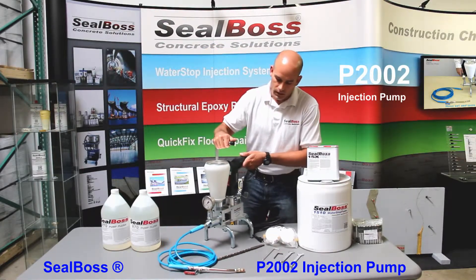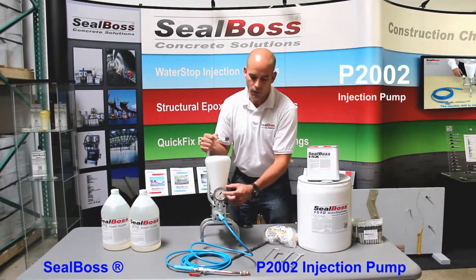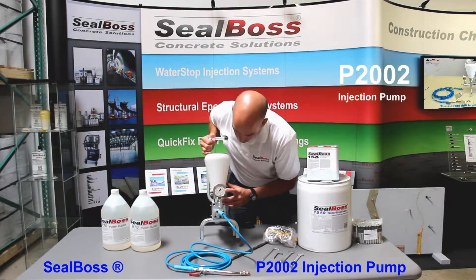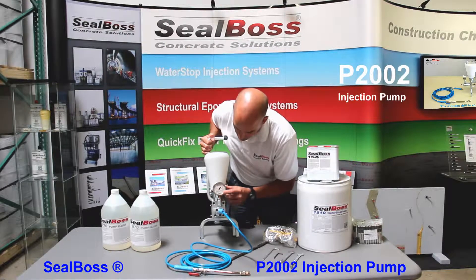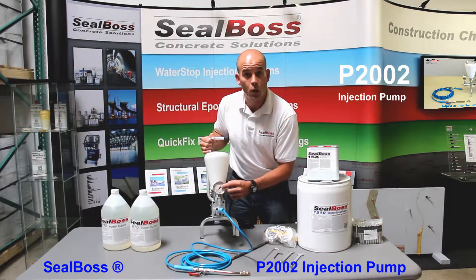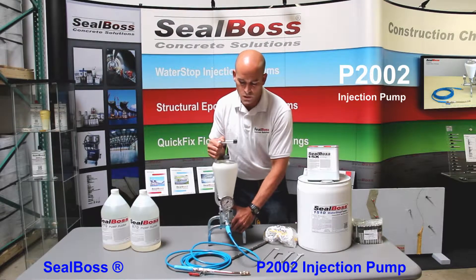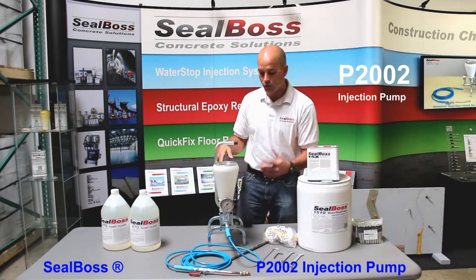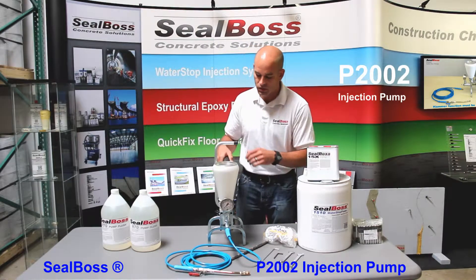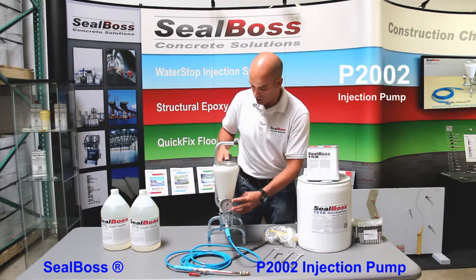A good indicator is by taking a look at our pressure gauge here. At the front of our pump, we do have a pressure gauge and it's noted both in psi as well as kilograms per centimeter squared. Here in the States, we typically go with the psi. A good way to make sure that you have a good injection but also don't overdo it is to have somebody monitoring the pressure gauge during an injection.